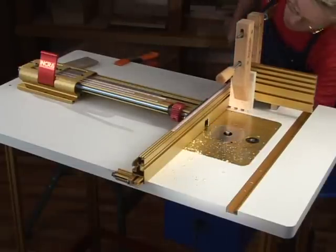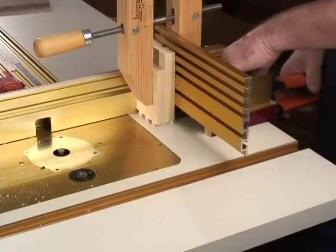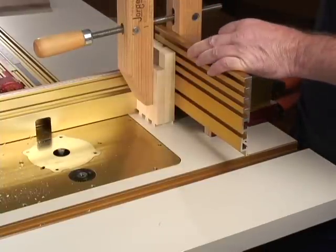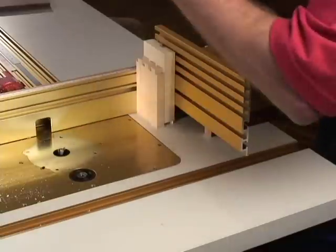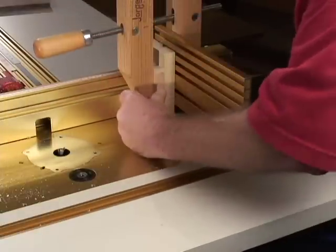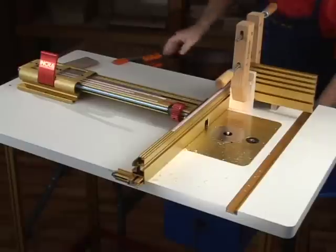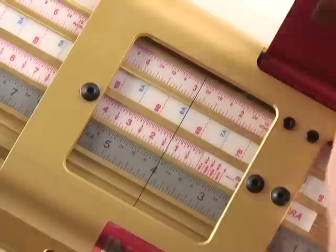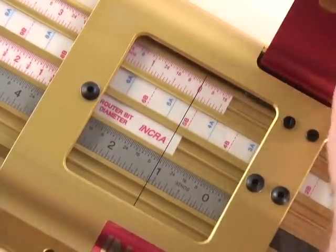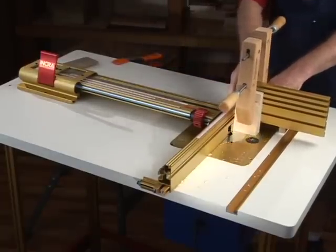After completing the cuts, immobilize the right angle fixture by clamping to both the fence and the table and flip the stock over. Make sure the stock is pressed securely to the table and against the fence before clamping in place. Return the fence to a scoring pass location, then repeat the cuts on the tailboards.